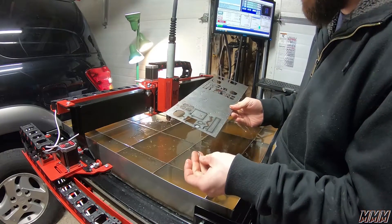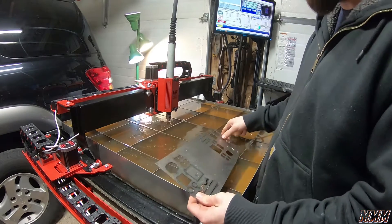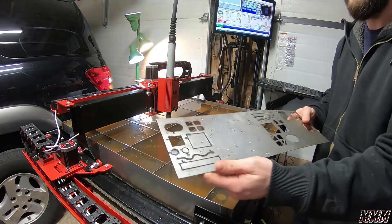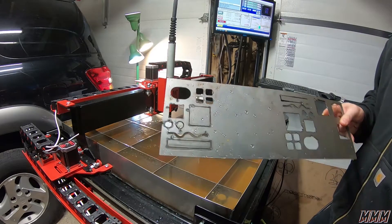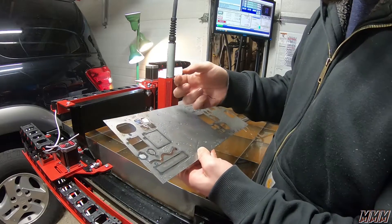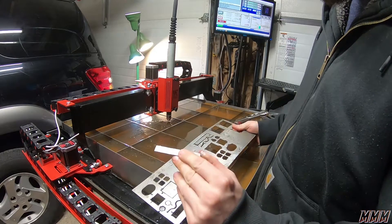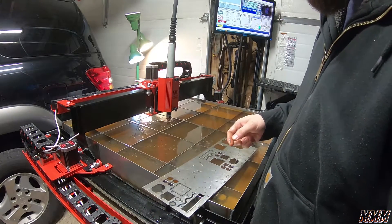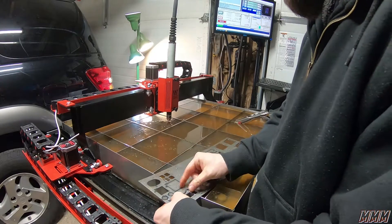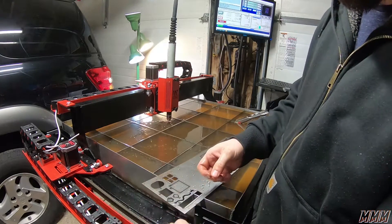This time we cut it with tabs, and I changed the lead-in and lead-out from the curve swirl type to a perpendicular cut. I still have an issue with it pausing towards the end, but it's a little better with the perpendicular cut. I'm not sure what that pausing is about. Here's our part — one of them. Here's the majority of the little squiggle. This is kind of a test cut to see how small it could do.